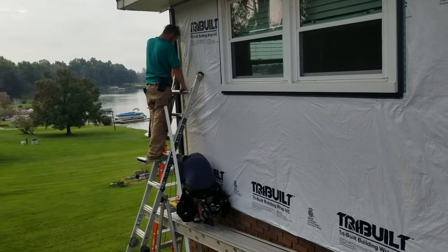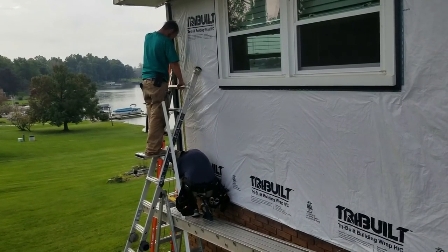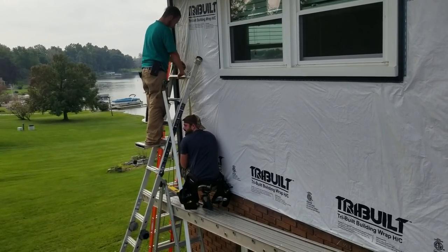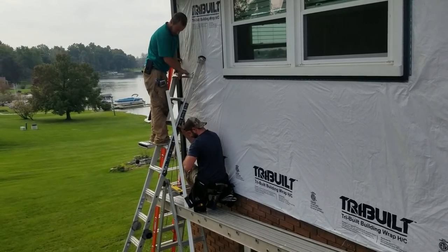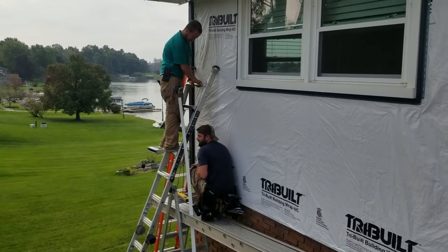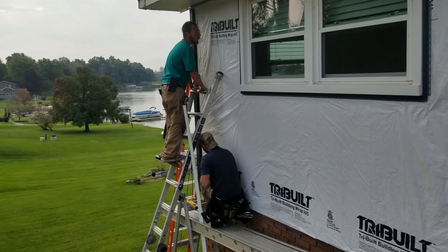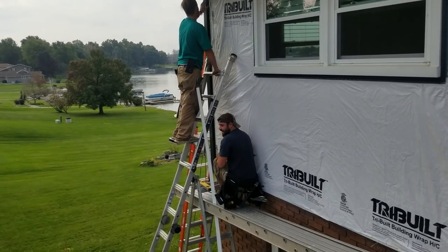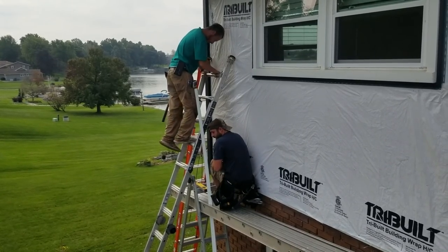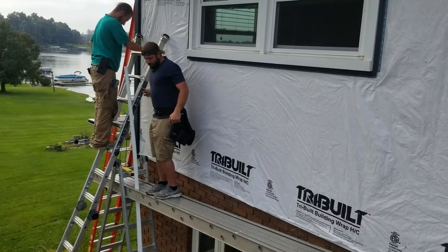Yeah, it's real close on our bottom there, but look, I'm gonna do 3/4 because that's an 1/8 of an inch. Oh, why am I yelling, like my mic ain't right on my chest? All right, I'm gonna do 85 3/4 because an 1/8 of an inch is nothing in vinyl to make up or to lose. So that way it makes it a little bit easier for us to snap our piece into our starter, because this metal is really close to the bottom and our lip's gonna hit it. It's gonna kind of screw us a little bit.